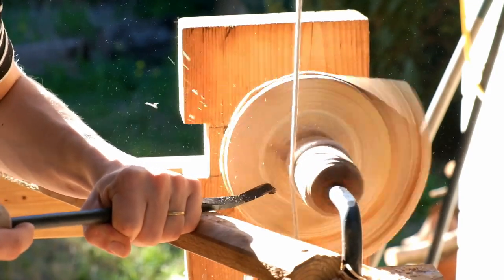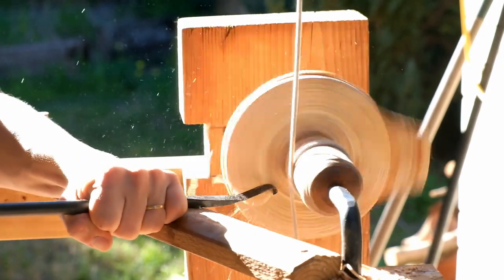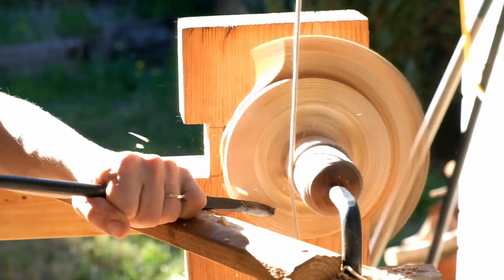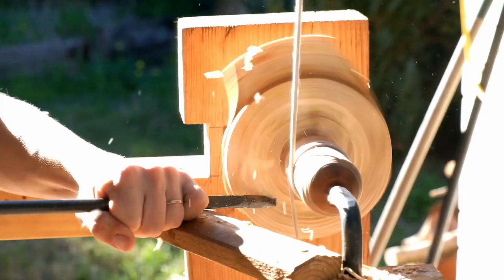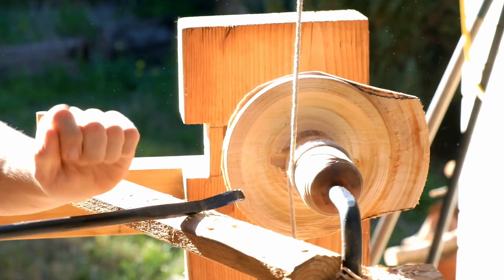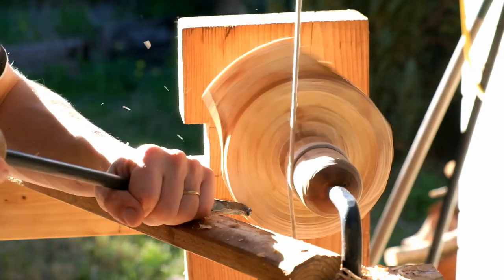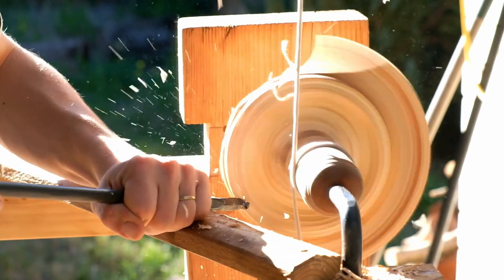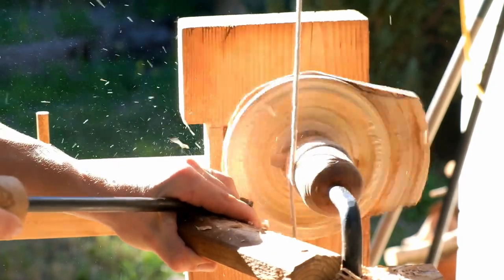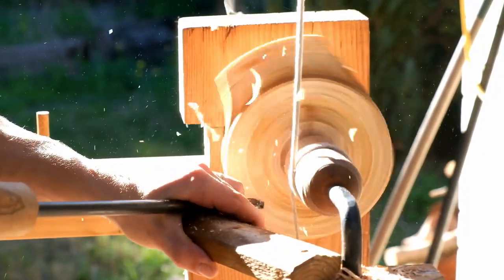You can see me just flip the tool around and then use the exact same hook to cut in the tip-down orientation for starting the core of the ball. What we're about to see is some of the issues that I have with this hook — they only really show up when you start to try to use it to hollow a ball. It's cutting nicely but it's a little bit catchy, and it does have one major issue for me which is that the back edge will catch on the return stroke if you don't lift the hook out of the wood enough, and I'm not in the habit of doing this because I have learned how to turn using single-edged hooks.